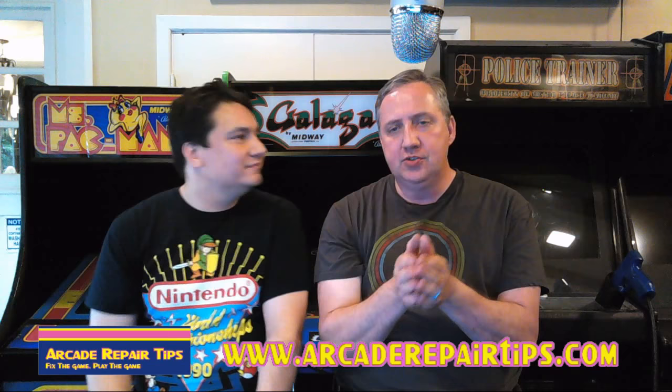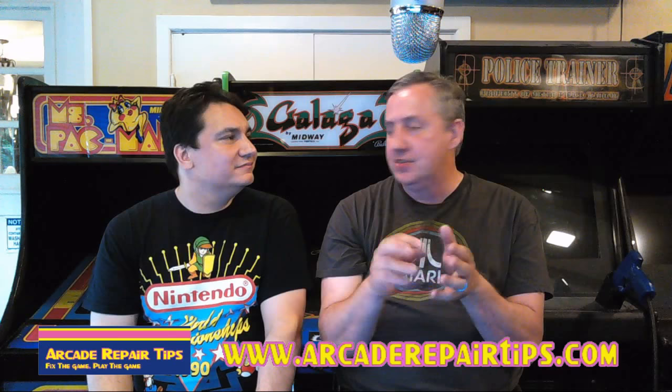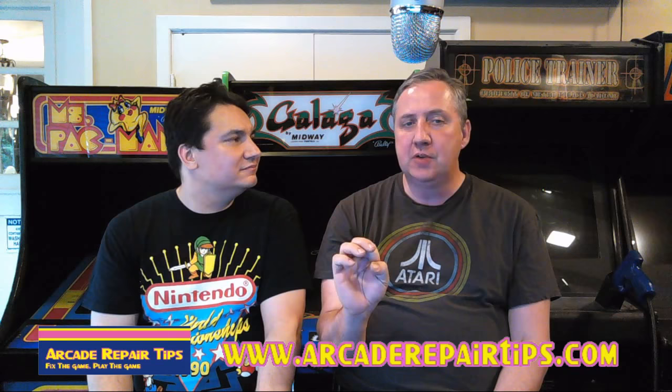That was enough. I think he misunderstood the purpose of the video, which was to show how to adjust that particular kind of mech. Right. We mentioned that you cannot just put any kind of token in. In other words, if you want to use a really small token or a bigger token, you've got to have that kind of mech. Right. But you can use those steps to adjust that mech once you get whatever your token is. Right. So coin mechs are typically designed for a currency.